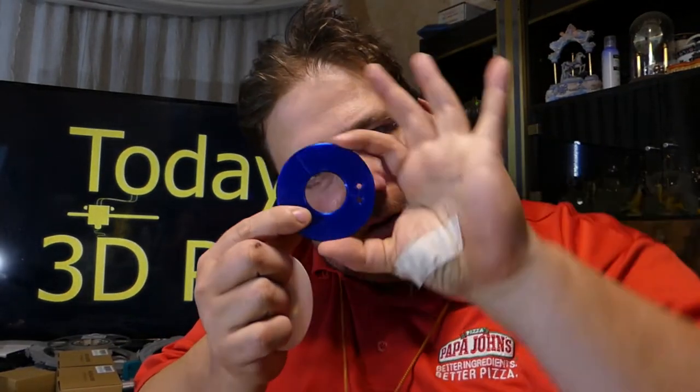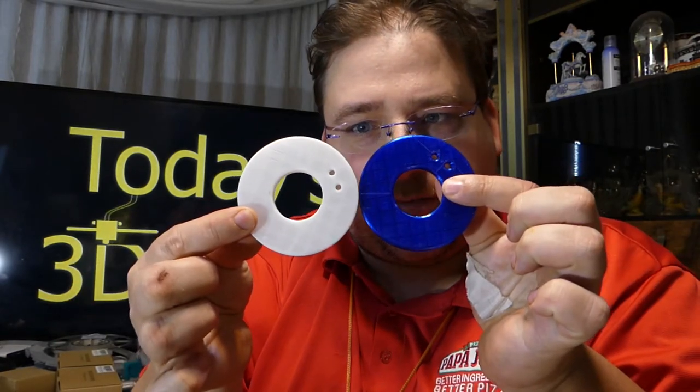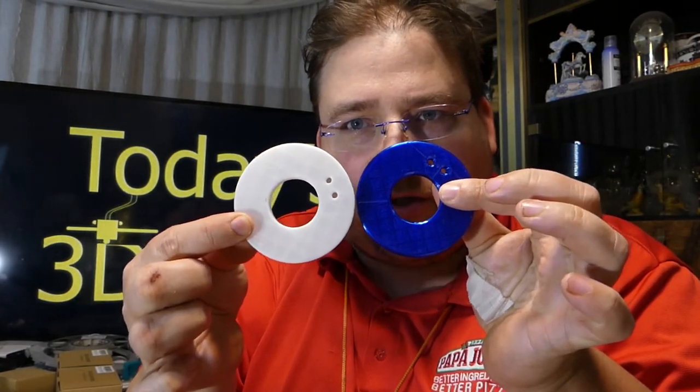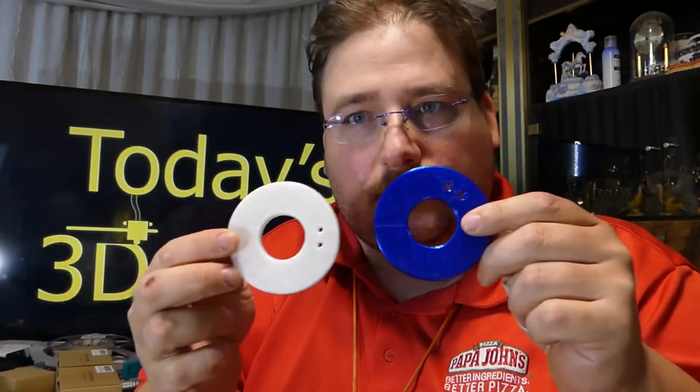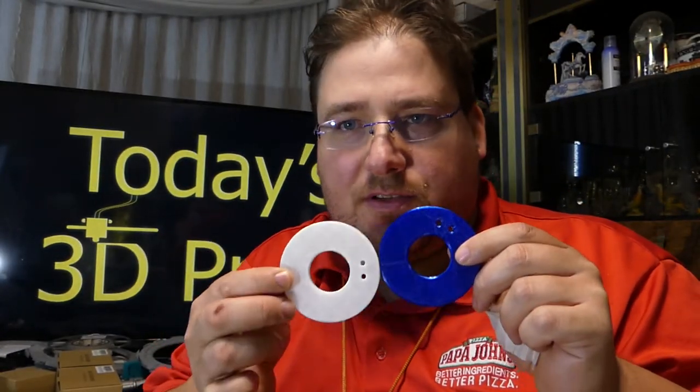But the problem is, if you have a 0.4 millimeter round extrusion of plastic that you're laying down to design your part, and then you go up 0.4 millimeter to your second layer and you lay down your next extrusion of plastic on top of that, they can only touch by this much, plus whatever you get from gravity pushing them down, which will eventually cause a gap. Okay? That's a point contact. So we've discussed this before in the CR10 leveling video, this doesn't work.